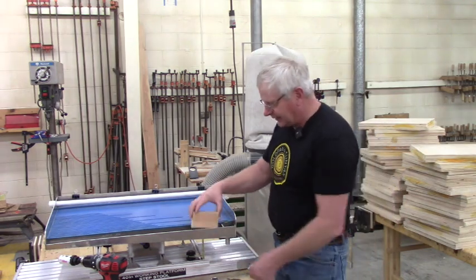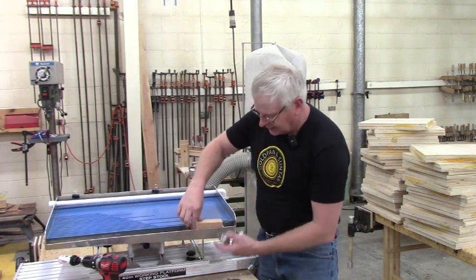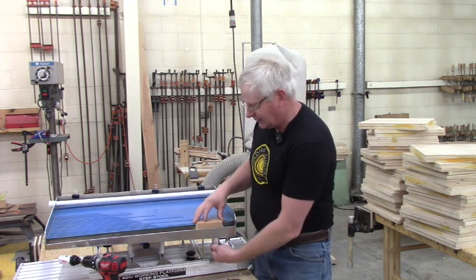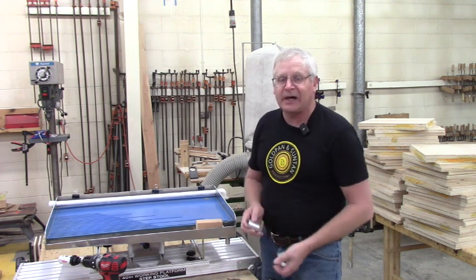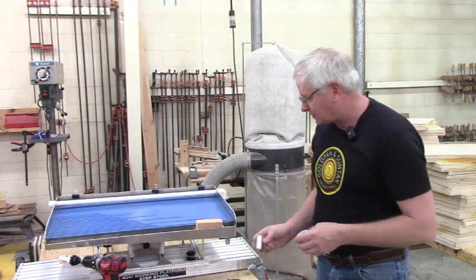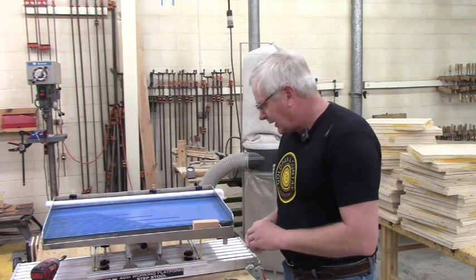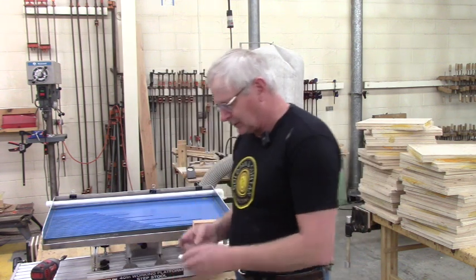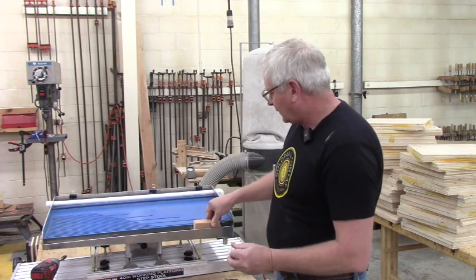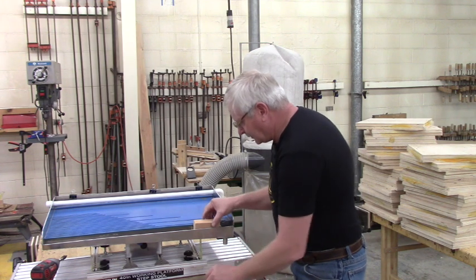So this is what I came up with to get this thing mounted exactly where I want it. It's just a little block of wood and I can put a clamp on there to hold it in place, and this will fit up where it needs to be. I just need a washer over the top and then I can use a screw to screw into that piece of wood and hold it in place — gives me plenty of room to get epoxy around the outside. So I'm going to use this inch and a half hole saw to make a washer out of aluminum. I've made a washer now that will fit over the end of this, and a screw that will fit through here and screw into the block of wood.